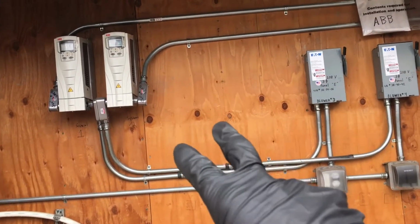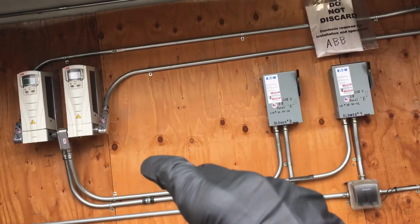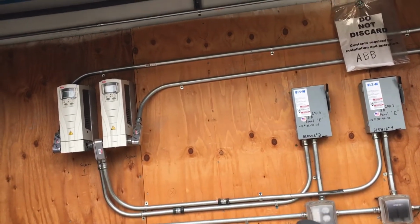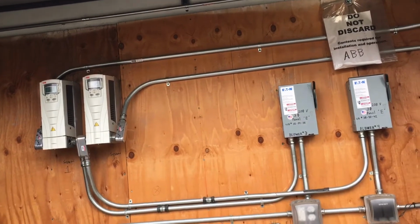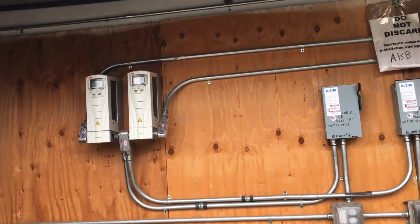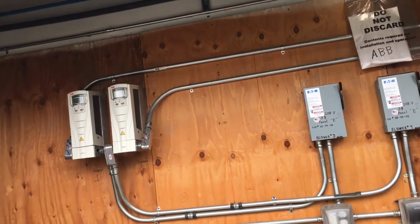And we have one at home on our air handler in our house on a 1950 GE or Western Electric old furnace. We converted it from an old PSC motor to a 3-phase ABB system, and that was his first system to learn how to use these. I gave him one as a toy to set up at home and convert a 1950s home furnace to a 3-phase motor,